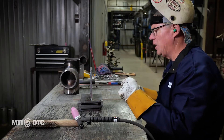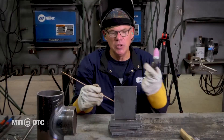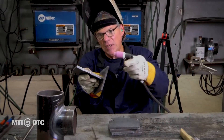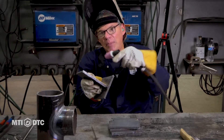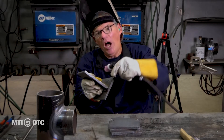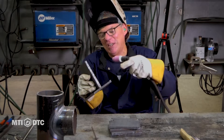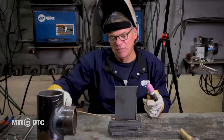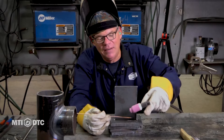Don't bust me on that — I know flat from horizontal, it's just a habit. When you stick this TIG rig in a groove like this, you have an automatic tendency to walk the cup. We're not technically rolling that barrel, but we're definitely getting a uniform wash back and forth. Basically what you're doing is laying your wire in this groove and just rolling this thing back and forth like this.